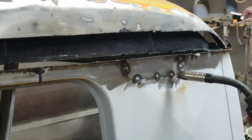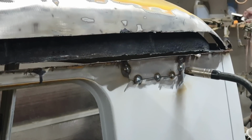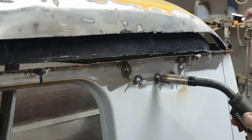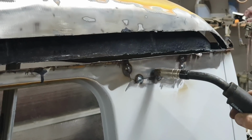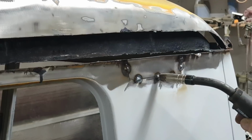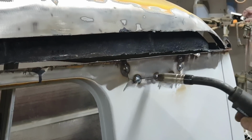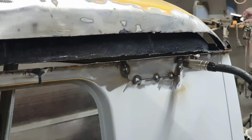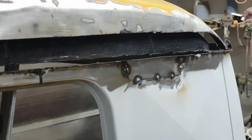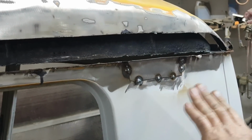Usually, once you get a little bit better, you'll start out with just doing a spot weld right next to that one, and one right next to this one, right next to that one, and you want the weld to go from this metal to the weld, and then to this metal. So you make like a C, okay? Little C, little C, little C, all the way around, and you do that evenly throughout a panel and give it a little chance to cool.